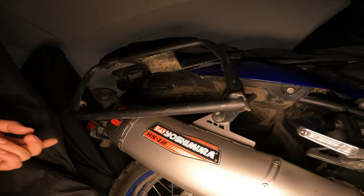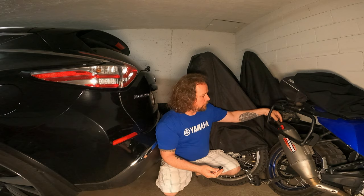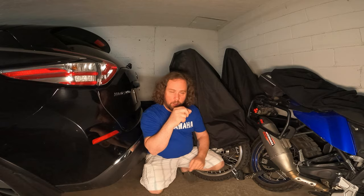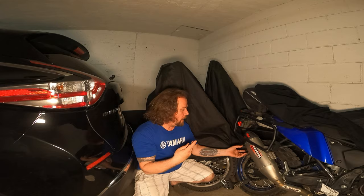The spark arrester comes with a tiny little screw, which you're kind of balancing on an Allen key, and you're trying to get this into the exhaust. If you mess up that screw as you're putting it up through that hole on the carbon tip and it falls off, it falls inside this carbon tip. To get that out is a pain in the ass — you'd have to physically take off the whole exhaust and dump it upside down just to try to get that screw out.